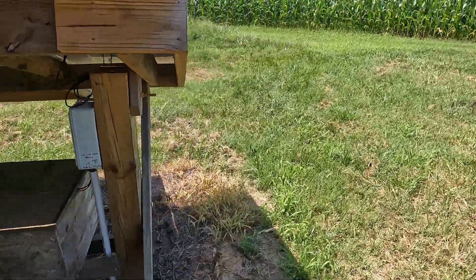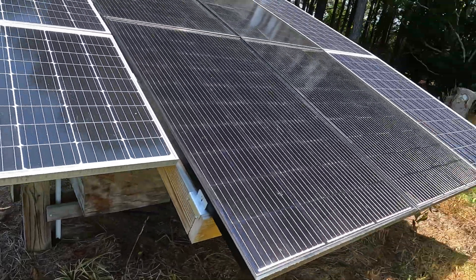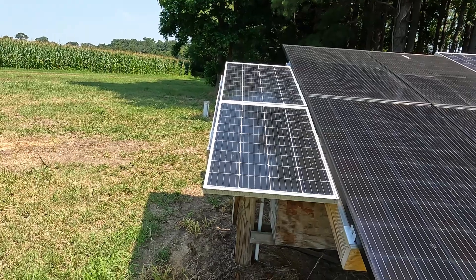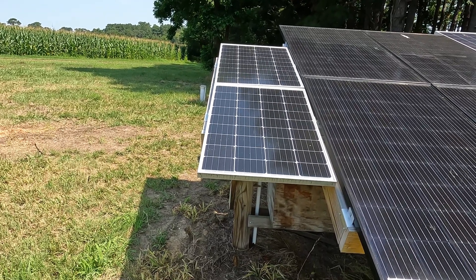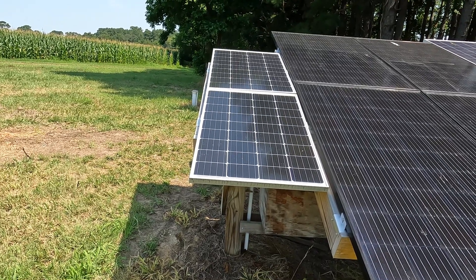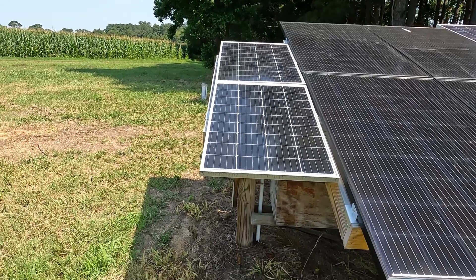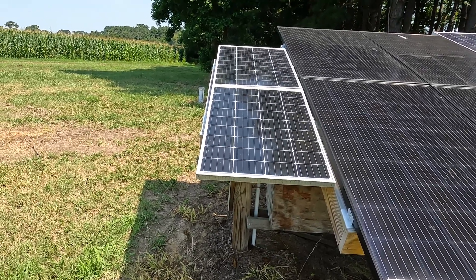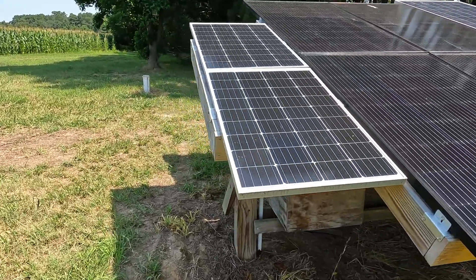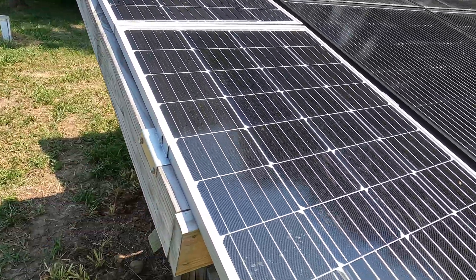So I'm going to add two more panels here. All of this is my main solar, and these two panels on the side are 200-watt panels just for the solar water pump, which has a slow-start helical mechanism type submersible pump in the well. It works good in most situations, but I want it to work a little bit better. So I'll go ahead and add the two panels by putting some more brackets on the side and placing the two new panels next to these two.